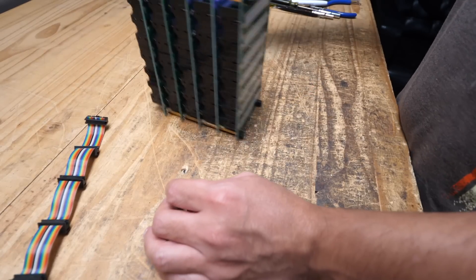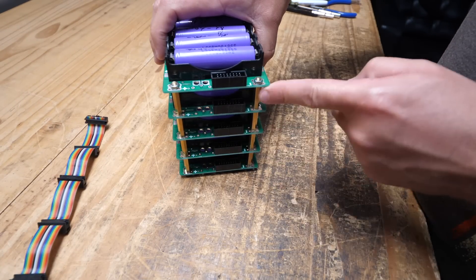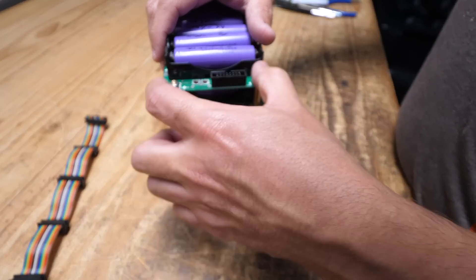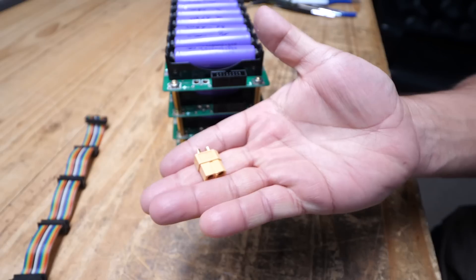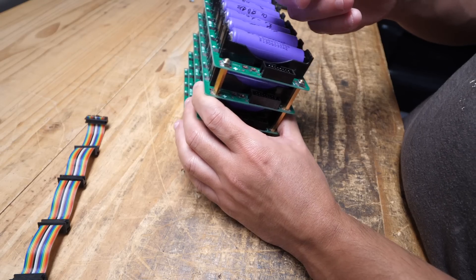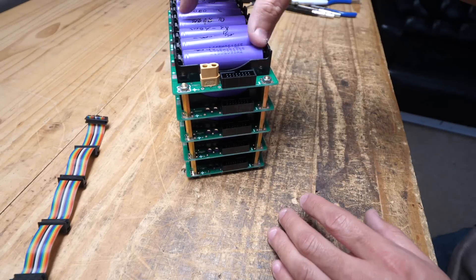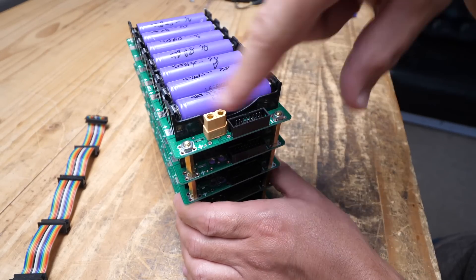To connect these boards together, the main conductors are already connected by the standoffs. Each standoff carries the current from each board, so all 29 volts from each individual board is connected through here. You can put lug terminals here and all boards feed equally. With the kit you also get an XT60 connector — if you want to use that as your power exit point, you'd solder it in here before populating the board, removing at least one cell first to get access.